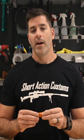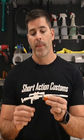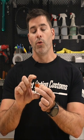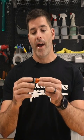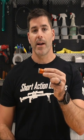One of the more common questions we get is why is there play between the insert and the body when the assembly is together. There's a very specific reason — I wanted a quick tool-less install and removal of the inserts from the body. More importantly, if it was locked up tight with the O-ring, the O-ring would be under pressure and you would not get simple, easy metal-to-metal contact. You would always be battling the compression of the O-ring and it would be spongy, giving inconsistent results. With play in there, we ensure the angles of the body and inserts are fully contacted without any O-ring influence, giving you more consistent and accurate measurements.